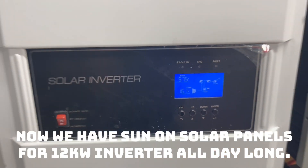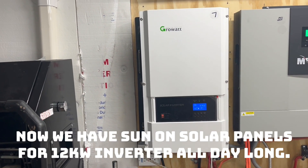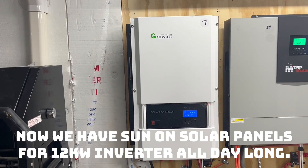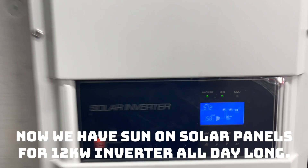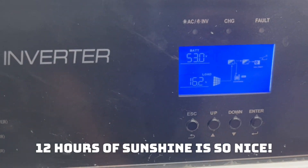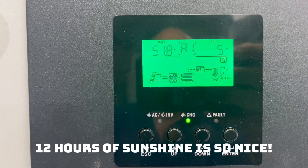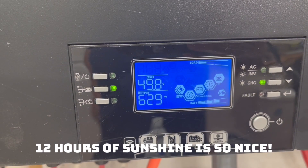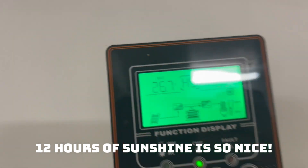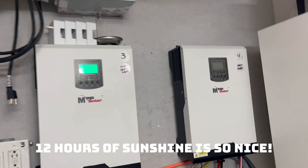We are at right on 16 percent of our 12,000-watt capacity — though we don't have 12,000 watts hooked up, only 21 250-watt panels. We're back up to 58 volts on the battery, temporarily dropped to 53. This battery bank is at 51.8, this one is at 49.8, and this battery bank over here is at 26.7 to 26.9.